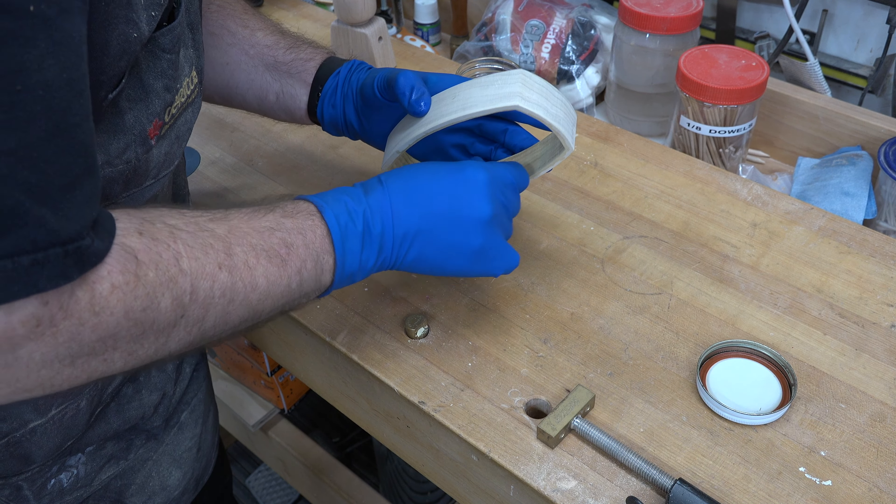With that dried, I'm going to give it a wet sanding — a very light wet sanding with some 600 grit paper and a little bit of mineral spirits. If you don't have mineral spirits you can use varsol — anything basically to keep the sandpaper from clogging up. That will be the only finish we need on the inside of the box. We can then move on and glue this thing together, using a very light bit of glue in the rabbet to glue the bottom in.